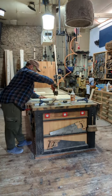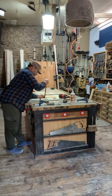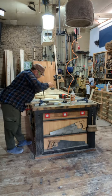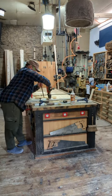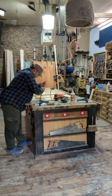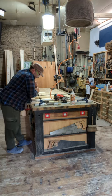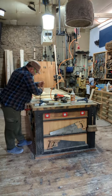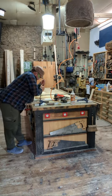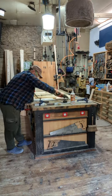Put that one there, I think. Getting there. There you go. Have to have that space in between the boards. If you don't, potentially you're going to have a bent shutter, because wood, no matter how dry it is, is still going to take on moisture, as well as obviously drying out in the summer.